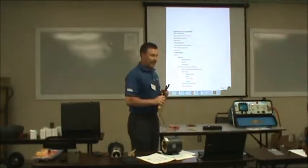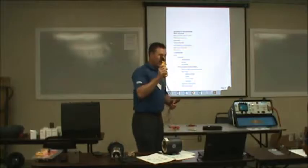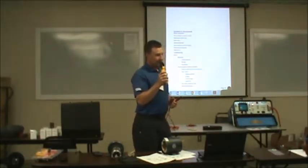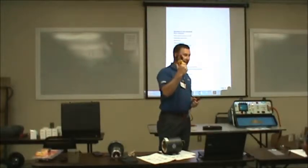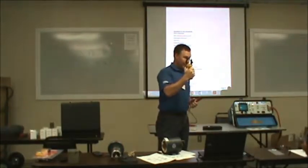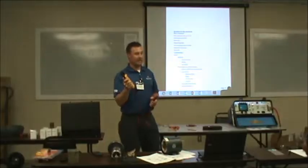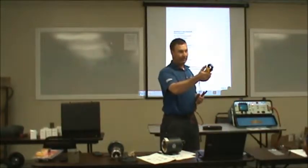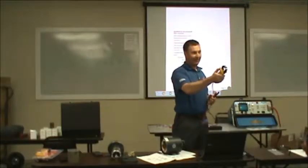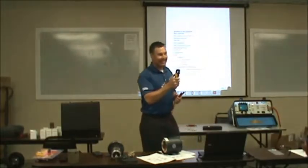All right, the next, the most important test about a motor is that right there. I ask people when they put a pump in or they start a motor, how many amps is it pulling? Greg, how many amps is it pulling? 31. That's about right.